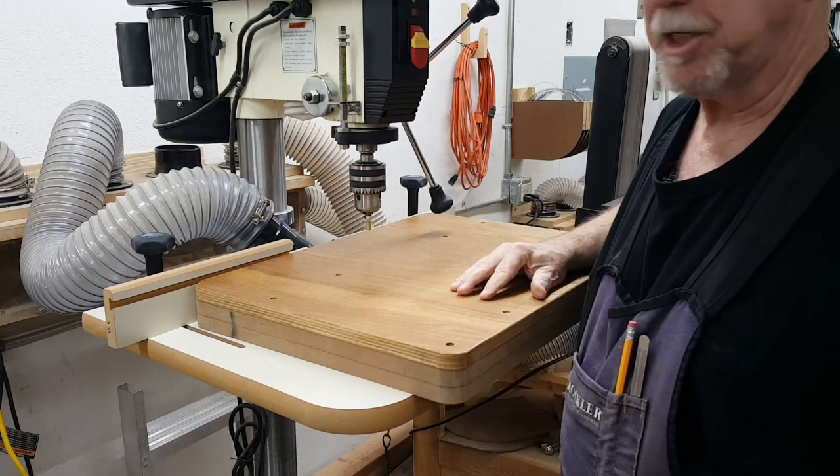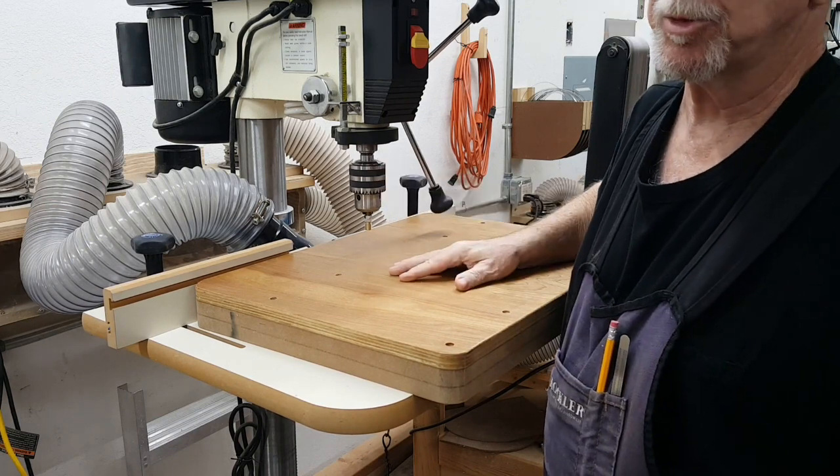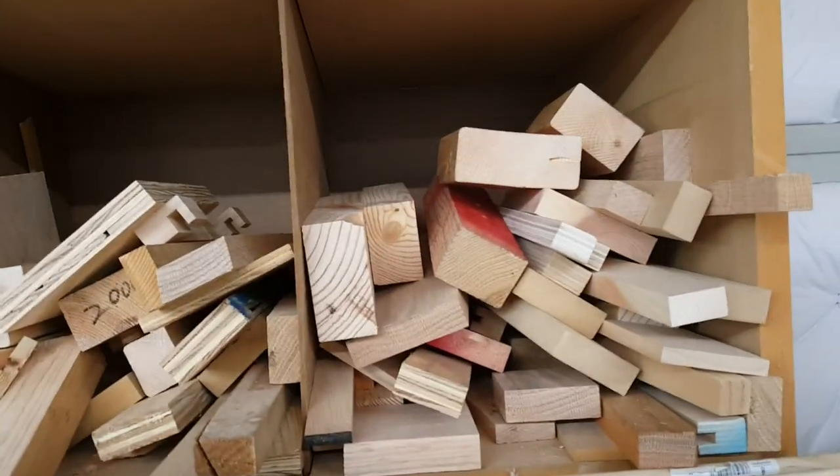This is just not going to work. It's too big and unwieldy to do it up here on the drill press table. I'm going to need to build a jig. The idea with this jig is to go ahead and use a socket wrench on the bolt to screw the insert in, but use a thick piece of wood to hold the bolt straight as you do so.